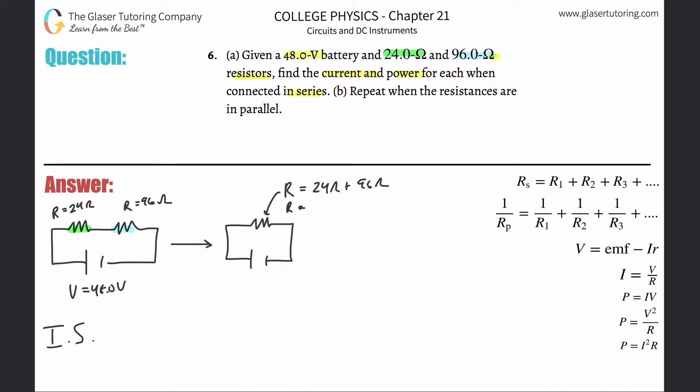When we add them together we get 120 ohms. The formula for total resistance in series — the equivalent resistance — is simply the sum of all resistances. So I can draw a new equivalent circuit and I now know the total resistance. I can apply the given 48 volts across this single equivalent resistor and calculate the current.